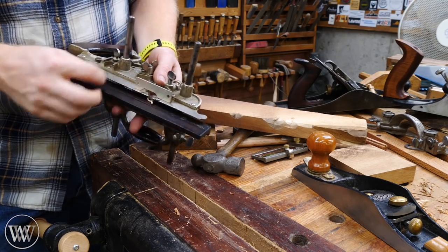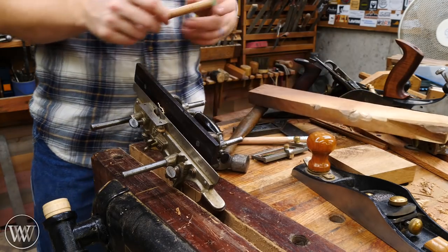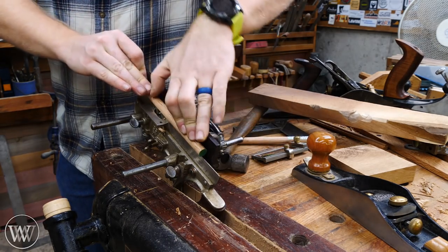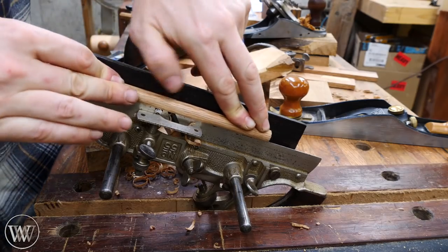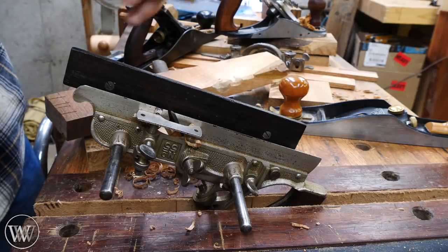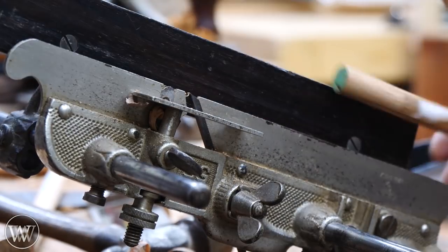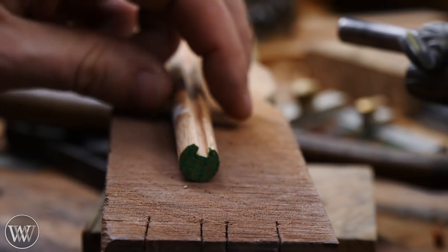Now, before I go any farther, I want to create corner dowels to hold the plexiglass in place. Originally I was planning on gluing the plexiglass together to give a seamless corner, but then I thought, I've never tried cutting grooves in a dowel — this would be something fun. So I was experimenting with a bunch of different ways, and I found this to be pretty much the easiest, where I put my 55 — or you can do something with a 45 or any plow plane — and locked it into the bench so that I could push the wood across it. Once there is a groove, the ski holds it in place, and it wasn't very difficult at all to keep it traveling in that same groove, and we got one groove out of it.